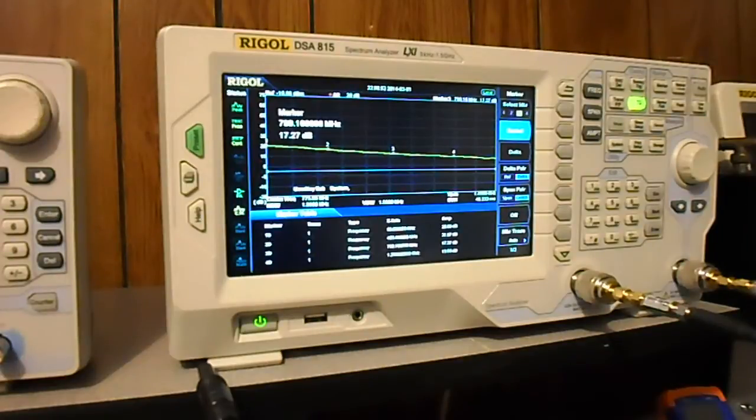The last point I have is 1.2 GHz — close to the ham 1296 MHz band. Their data shows 14.22 dB and I've got 13.93 dB. As you can see, those are really close.